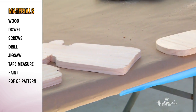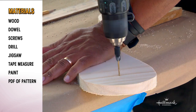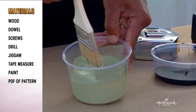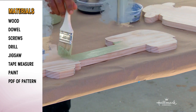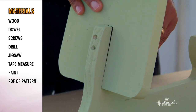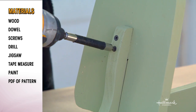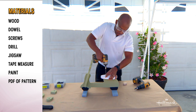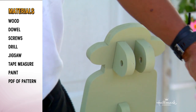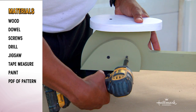I used regular pine board. Get them all cut, give them a sanding to get rid of all the rough edges, then the pieces are going to get screwed in. I like to do pilot holes with a countersink bit so the screw heads go in flush with nothing to scrape. I find it's easier to paint everything up front before assembling — then it's like paper doll technology. Slide things in and use your screws to fasten everything in place. You have the two big side pieces, two horizontals, the seat, and the handlebar holder.